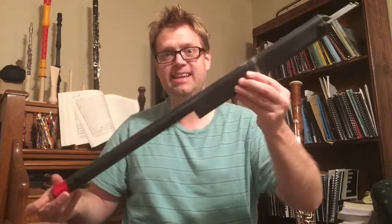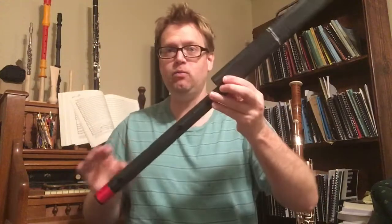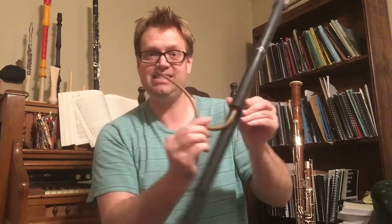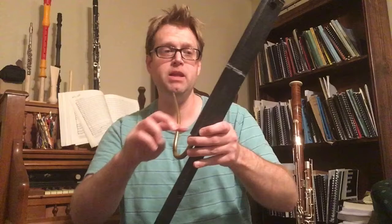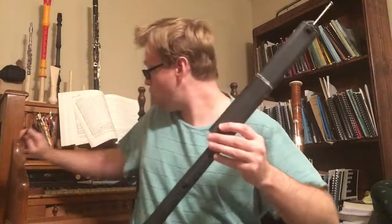To give you an idea, this is the entire wing joint. I've got a bocal here — this is just my regular bassoon bocal. The bocal is going to fit in underslung like this. The actual bocal will be a bit wider and only about 10 millimeters longer than a traditional bassoon bocal. The tube goes up, we have a U-bend here — so it's actually a second boot joint — then down and through here, giving the entire wing joint.